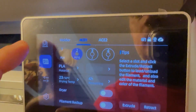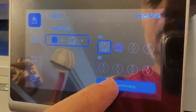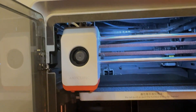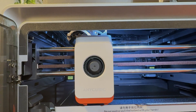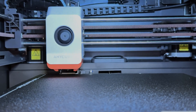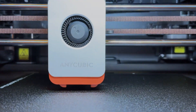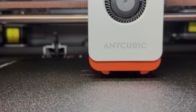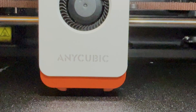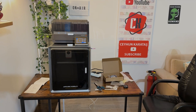Now I can go back to the print page and press start — here we go! The printer first performs processes like bed heating, nozzle heating and nozzle cleaning, then performs a bed calibration, draws the filament and begins printing. With the printers I used before, we had to do a lot of things manually — for example, we used to perform bed calibration using A4 paper. The S1 and similar printers do this automatically. Processes like filament changing and nozzle cleaning are now also automated on the S1 and its competitors. And here we are, seeing our first filament flow in the hotend of our printer!